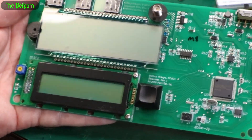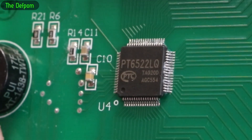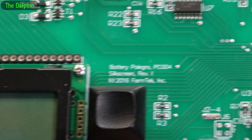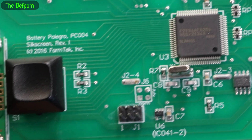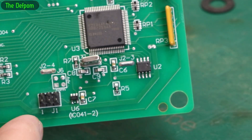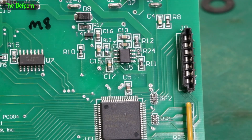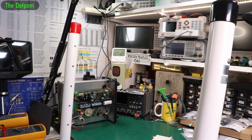This is why these things must not get wet. With the display off, you can see the corrosion on those pins. I've brushed it off and it's mostly come off, but I'm still going to need to reflow these just to make sure the corrosion has stopped. All cleaned up — that chip and all around that section is cleaned up now. I might need to get some more flux off there, but it's basically done.